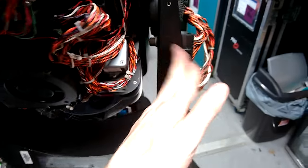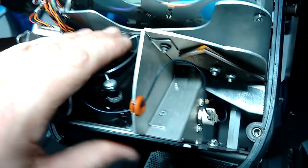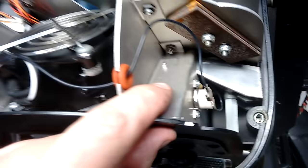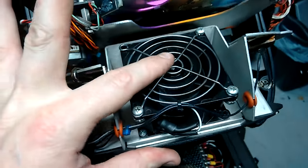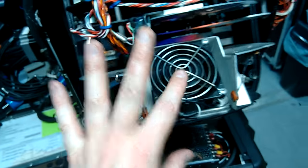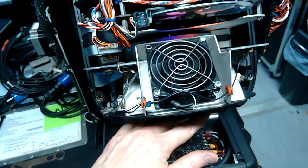Quite complex and expensive plates — I wouldn't like to break one. I've taken cracked ones out of lights before; I think they'd be quite expensive to change. That's fundamentally what's inside one of these units. This is the fan that cools the lamp housing, and that's the thermal cutout for the fan, switched through the relay circuit. These are mains voltage fans — there are two mains things coming up to the head: the fan power supply and the lamp power supply.